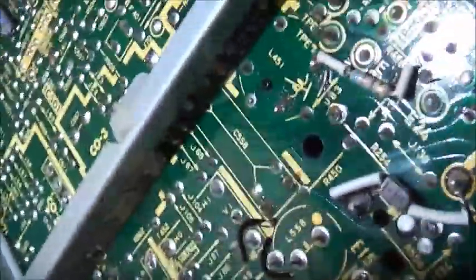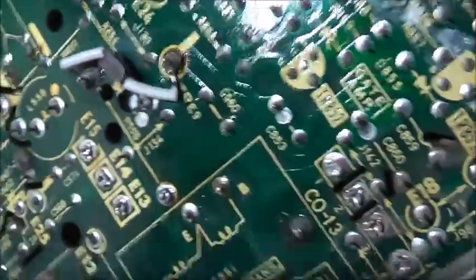I can't see any dry joints. It's in the power part where there's a lot of current and heat. I'll start with those grounding things. There's a grounding strap here — let's solder that. We've got a crack here, and that's going to here. It's grounding all this to this heat sink. Let's do some of this soldering.